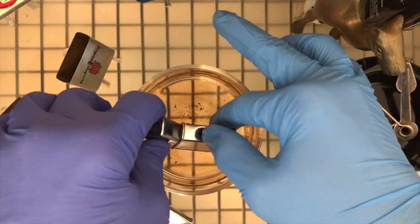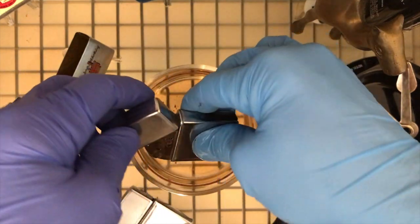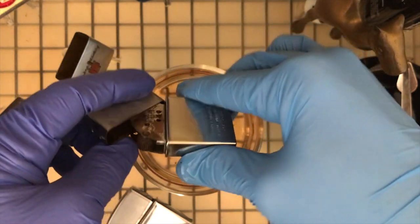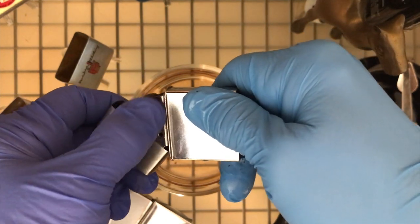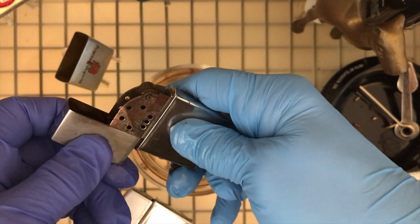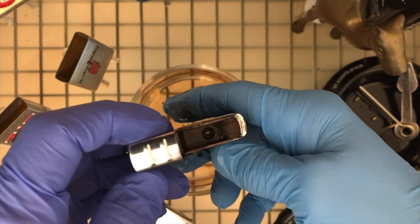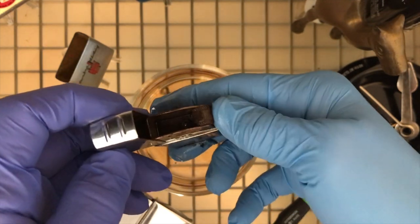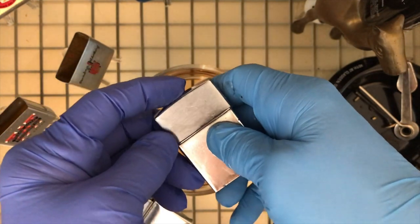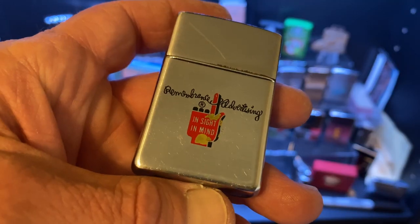After some heavy editing and maybe even a few days in the vinegar, you could see that the vinegar removed quite a bit of the plating — the only reason I really put it in there was to remove the rust. At least I learned something else: vinegar can have the effect of polishing damaged plating, which can erase it altogether, and will definitely wear it off faster than it normally would have come off.